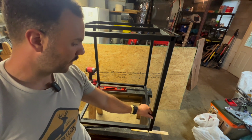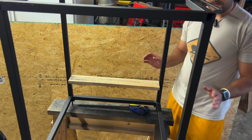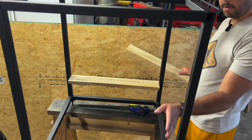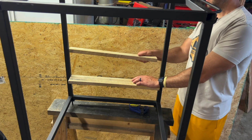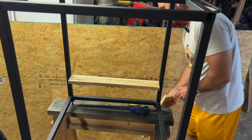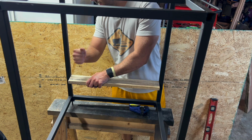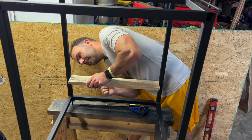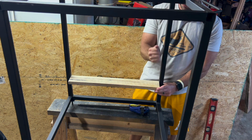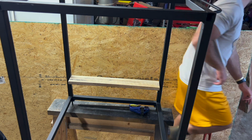It went surprisingly okay. All right, I'm going to look to get these attached. My two runners that I've made fit perfectly on this side, but this side is actually slightly shorter and that side's slightly bigger. It slides perfectly in on that side, but over here it's super tight. So I've been having to hand beat it in just a little bit to get it to seat. I think with the screw it should probably get where we need it, and I'll probably have to level it back out just a tad. I know this one needs to come out. I need a hammer.